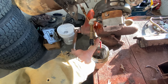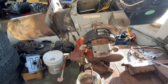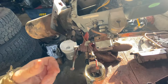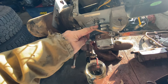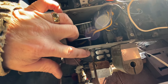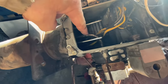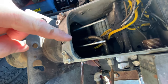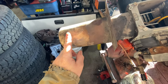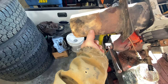To show something that will be more difficult once this is back in the unit - right here is your air inlet. Air comes in where in the old Beckett burner the fuel oil spot was; it's now air coming into the blast tube. That comes to the nozzle head right here, and of course the oil is coming down from the bottom side, so they're joining together inside the head.